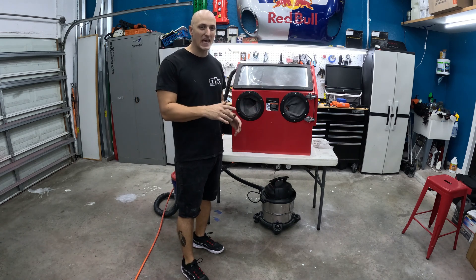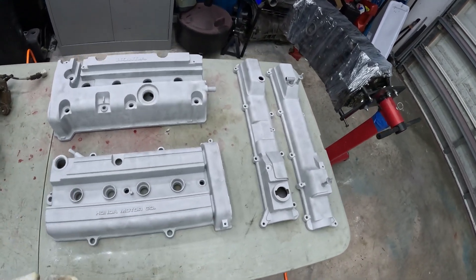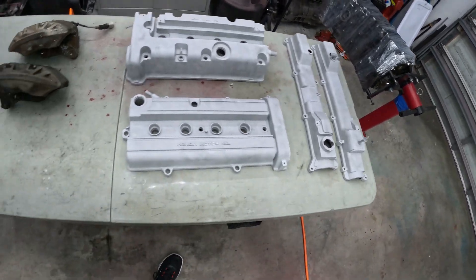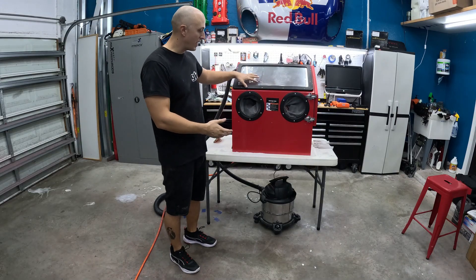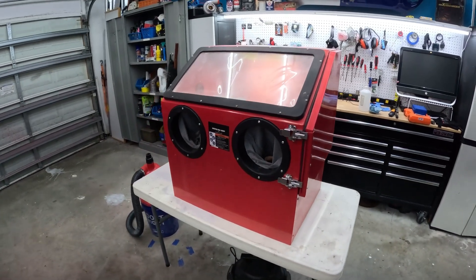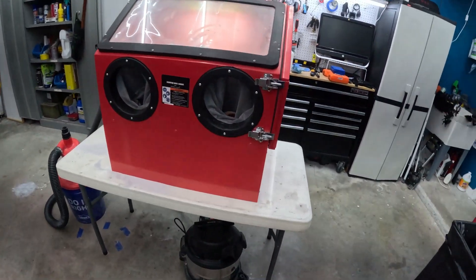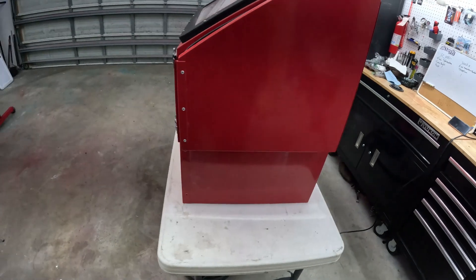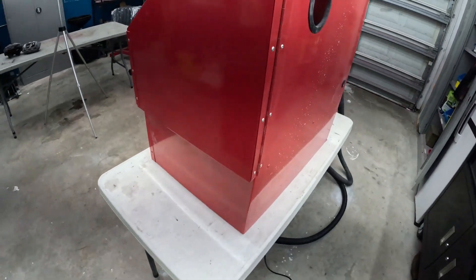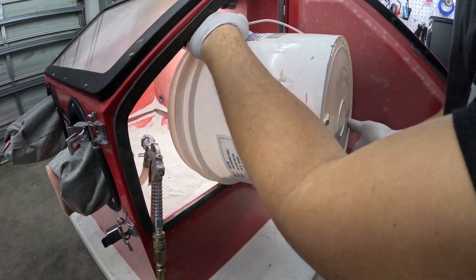We're going to do a few different things. Here we've got some valve covers for four cylinders, some valve covers for inline six cylinders, and brake calipers. I've got over here a 30-pound media blasting cabinet. For your standard benchtop blasting cabinet, these are made out of sheet metal and this unit unloaded weighs about 55 pounds. The 30-pound capacity refers to the blasting media — this unit can hold 30 pounds of whatever media we're going to be using.